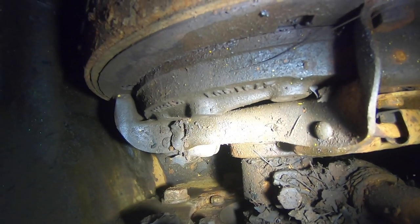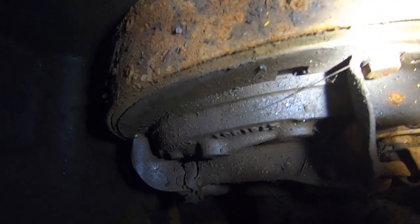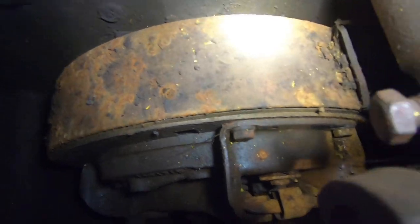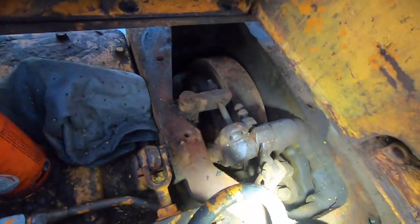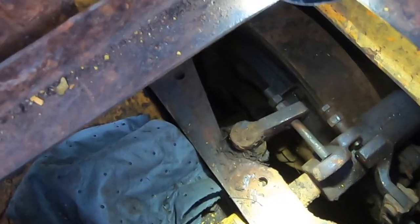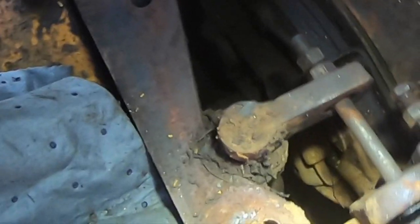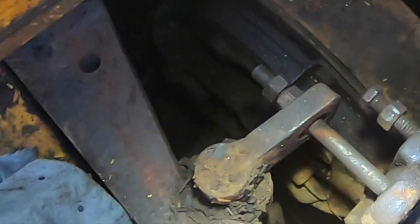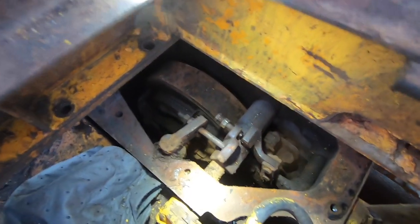This is the clutch plate, the pressure plate, and then behind it is all the stack of discs, and then the band on top. And then they're separate, they're actuated separately here with this. So let me pull this and show you what happens here. You might be able to see the throwout bearing pushing in. That all looks good. You can actually see the clutch come away from the disc and the brake band actuate. So everything works as it should in here.